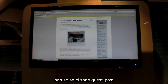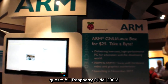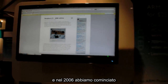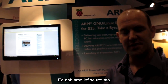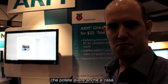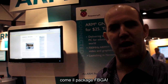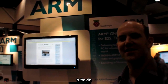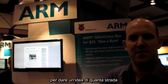We put up a post a few days ago to give people an idea of how long we've been working on this. This is Raspberry Pi from 2006 - we've been looking for ways to build very cheap computers for a very long time. Back in 2006 we considered building something based on an Atmel AVR chip - the same chips you have in an Arduino - and we found a way to make a $25 PC based on this. It uses only the sorts of components you can solder at home. Current Raspberry Pi is not really home-assemblable because it uses fine-pitched BGAs and requires reflow soldering. The nice thing about the 2006-era Raspberry Pi was you could build it yourself; the downside is it had maybe 1% of the performance of a current Raspberry Pi. In the end we gave up on that approach, but we posted this on the website last weekend to give people an idea of where we've come from.